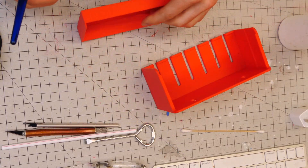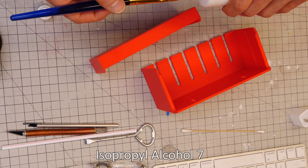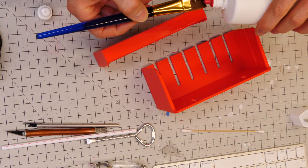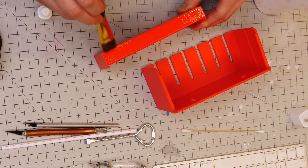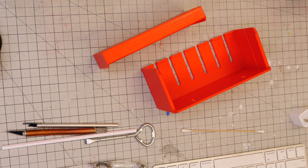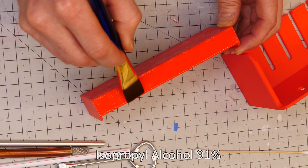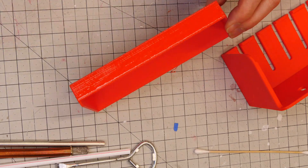For some reason I had a Polysmooth filament that fits the Ultimaker. What is Polysmooth? It prints like PLA — I use the exact same settings — but it reacts with alcohol. Here I'm laying down some 70% isopropyl alcohol to kind of test things out. Basically what it does is it melts the plastic. I didn't have a lot of luck with the 70%, but then I moved to 91% and got much better results — the surface started to get a little bit shiny.